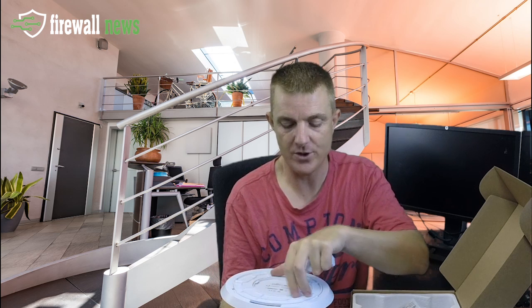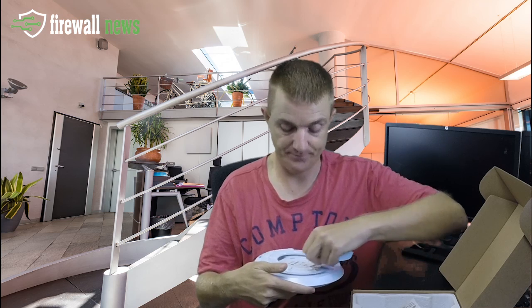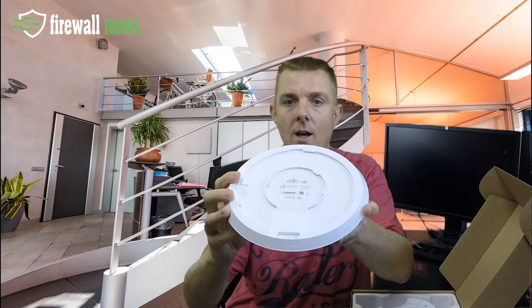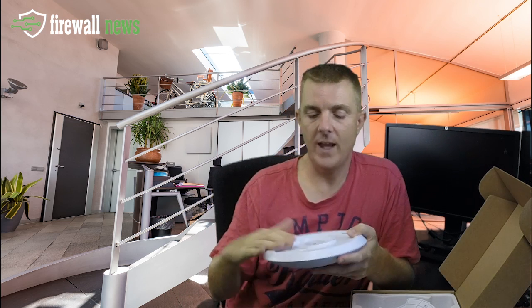In the same way as the AC Pro, this is weather resistant — I would use that terminology. So if you're putting this in an al fresco or outside area, that will work for you. They're not watertight or weathertight — you need to use the dedicated outside devices for that — but you do get a plug that comes with this which sits into the port, completing your weather resistance. It's good as long as it's not going to be hit by weather directly, but at least stops animals, moisture, and things like that getting into the device. It's not going to take driving rain or ice thrown against it.